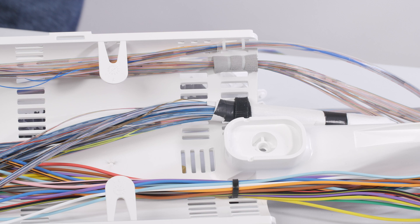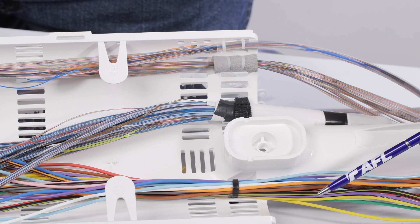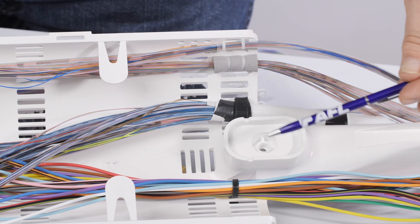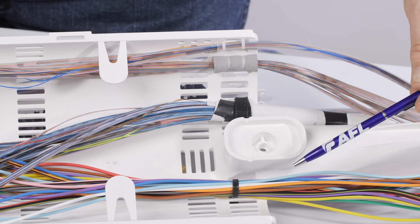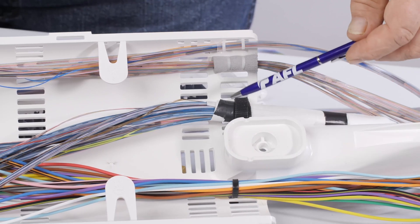When routing any type of fiber or tubes in the APEX basket, there are some generalizations to follow. The basket is designed to utilize many options for incoming and outgoing fiber or tubes to be secured in multiple locations. These retention slots are designed to accommodate both velcro and tie wraps. Tie wraps may be used on tubing, loose tube, ribbon, or transition tubes. The soft side of velcro straps should be used with AFL's spiderweb ribbon and all other fiber types.